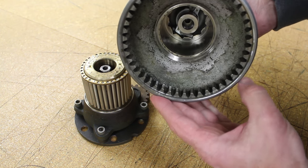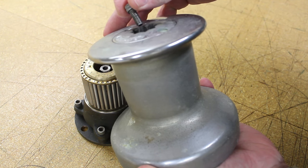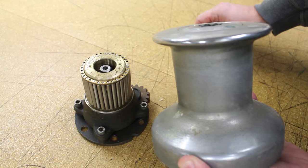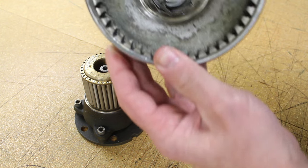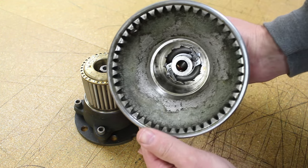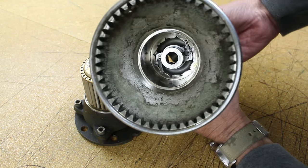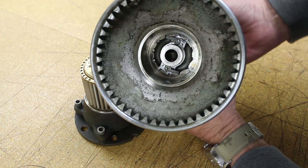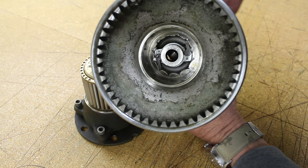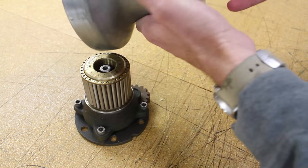You'll notice in the top of the winch there are two pawls that perform the camming action. This winch is a two-speed because the pawls in the top engage and lock the winch in one direction, and then another set of pawls underneath the spindle lock and engage the winch and a gear at the bottom when you turn the winch handle in the opposite direction.